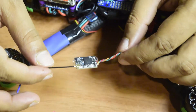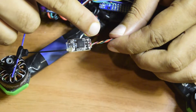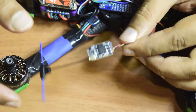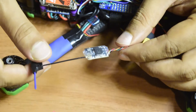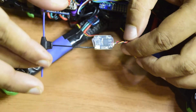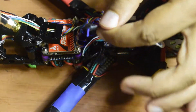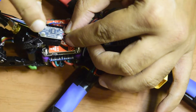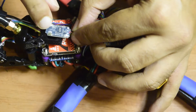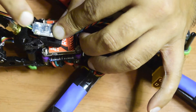The shrinkable cover is now properly coated onto the receiver. This is great because the heat shrink covers the connection pads, preventing short circuits, holds all ports together to avoid damage from movement, and keeps the antenna holder secure so it won't get loose during shock and vibration. To install it onto the drone frame, insert the antenna from the bottom and take it out the side. I'm positioning it so the bind button faces the top for easy access.